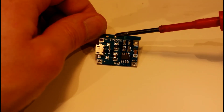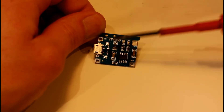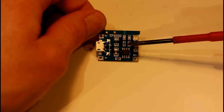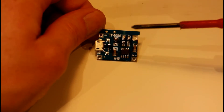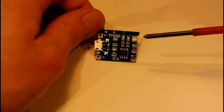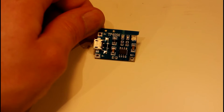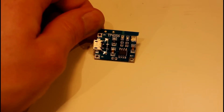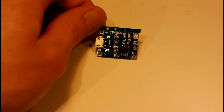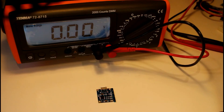That's the only real limiting factor. You can supply your 5 volts from anywhere using the two connections here, but it's probably easiest to use a mobile phone charger. That said, this can drive up to 700 milliamps, and your phone charger might be limited - whereas a different 5-volt power supply might not. You could have a supply that delivers an amp and this will just regulate that to somewhere between 200 and 700 milliamps.